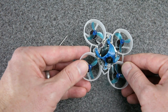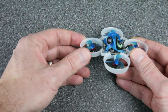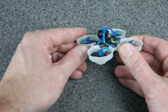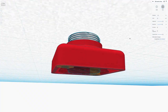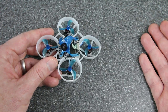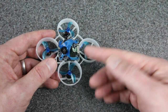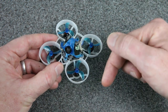He's got some more HD Zero-related content as well that you might be interested in. If you're thinking of modifying a camera for yourself like I did, I'll put a list of the exact parts I used down in the video description. I have an STL file for the body, and I've made my Tinkercad project public — so if you take that and ungroup the model, you can change all the parameters like the lens diameter, thread pitch, whatever you need to make it work in your case. Of course it's not completely without risk — you could damage the camera or the sensor board. Hopefully that is understood; all of that risk is on you. But it can totally be done, and I would love to hear what you come up with in the comments.